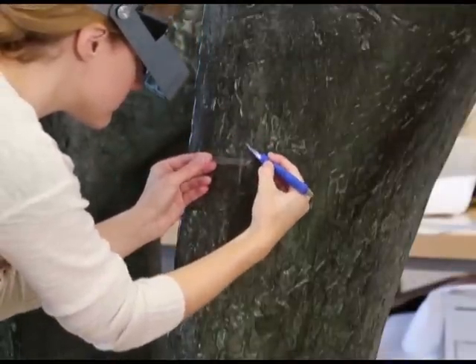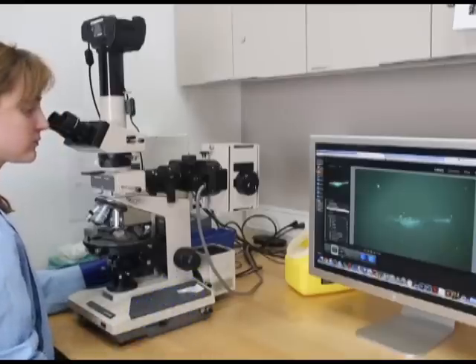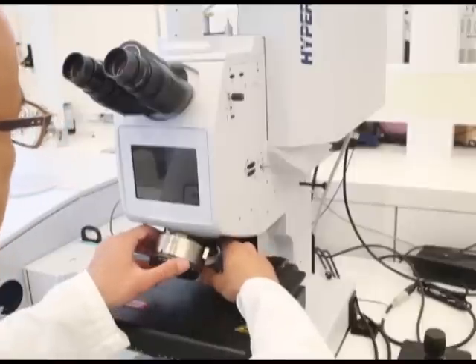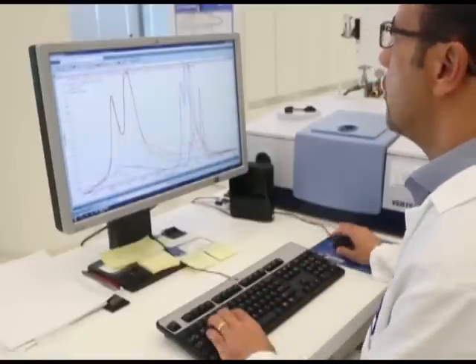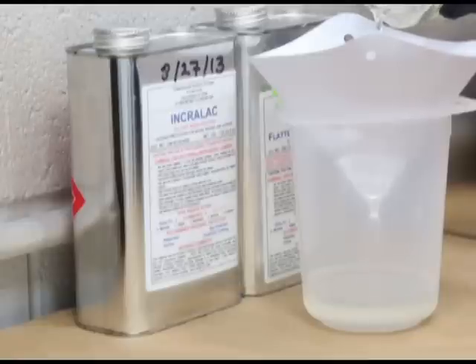Analyzing the coatings and how they were layered would help conservators develop the best removal methods. Many samples and cross sections of the surface were taken and analyzed using optical microscopy, scanning electron microscopy, x-ray fluorescence spectroscopy, x-ray diffraction, and Fourier transform infrared spectroscopy. We found several coatings. The uppermost coating appears to be wax. The ones we found primarily are ones that do have ester carbonyl functional groups in the wax, which could be inherent in the original wax used or sometimes due to photo-oxidative changes to the wax. After the wax layers, we begin to see more of the acrylic, or incralac. Sometimes the incralac is pure, sometimes it's intermixed with the wax. It's hard to say whether that was intentionally done, and the original appearance is something that will continue to be researched.